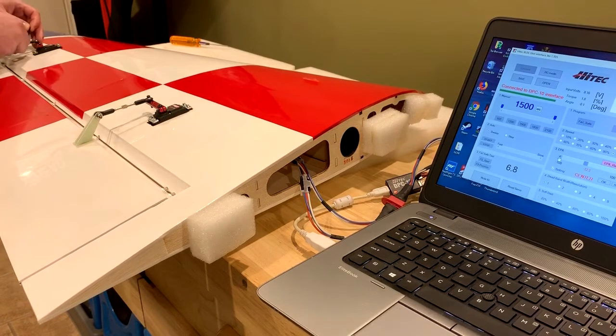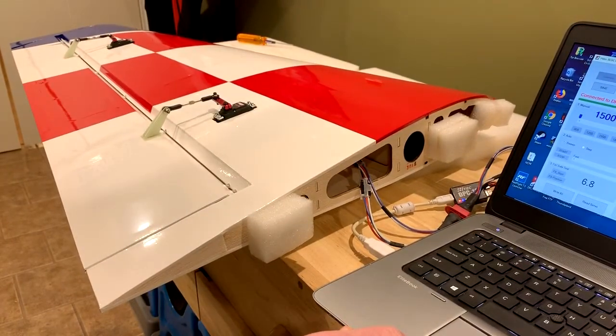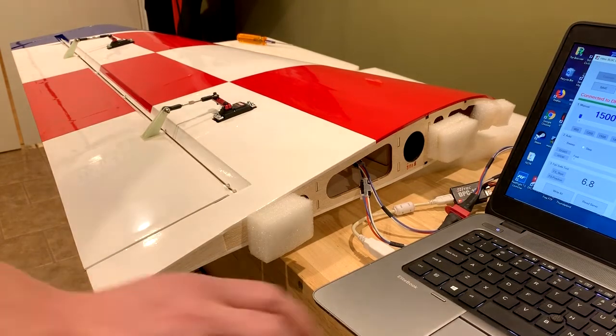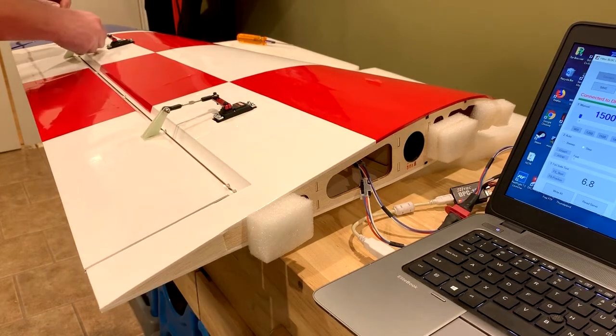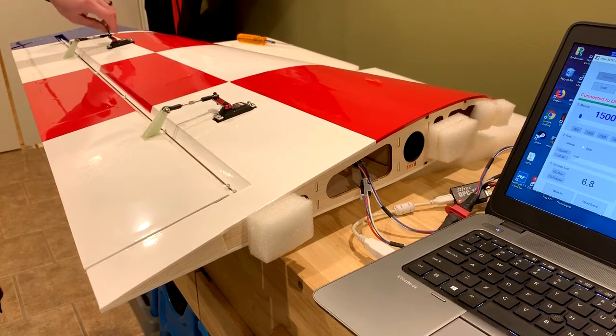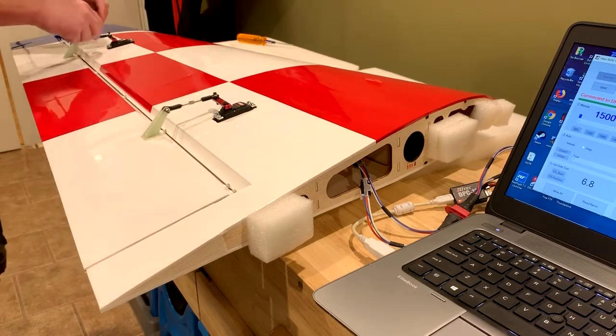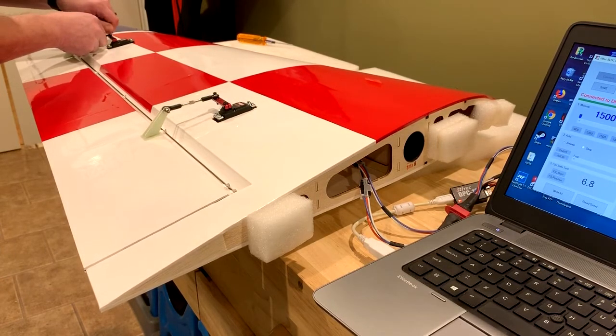We're going to keep moving it down until I lay the horn on here. Move it down a little bit, and keep moving until I see it right cleared through the hole. A lot more, a little more. You can see as I'm hitting the button, the servo is moving. Need a little more. At some point, you'll see it perfectly through. The test is how smooth it is to thread in. You don't want any binding whatsoever. The fact that this is going in really smooth tells me that it's good.